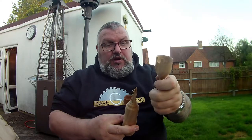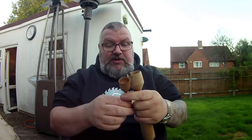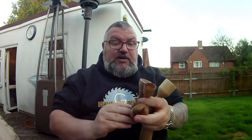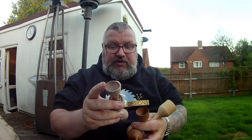So I guess the moral of this story is, if at first you don't succeed, try three more times and hopefully you'll get it. But this one, I got a catch when I was turning, snapped it. This one, I didn't have any support at the end when I was finishing it, snapped it. And this one, I cut way too thin on the actual goblet part and took the top off of it.